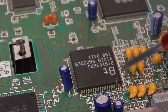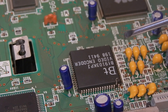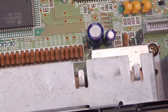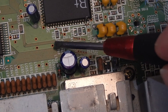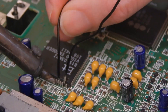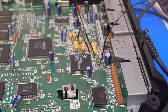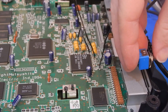So there is our pin lifted. I always hate doing that — you always run the risk that the pin will break off, and then we would be in serious trouble. I have cut three bits of wire to length. We are going to attach one to this pin, one to this pad here for 5 volts, and one to this via here for ground. That is our three wires connected. The next thing to do is drill a hole in the back of the case, then mount the switch. I will do that and then we will be back to solder it all up.